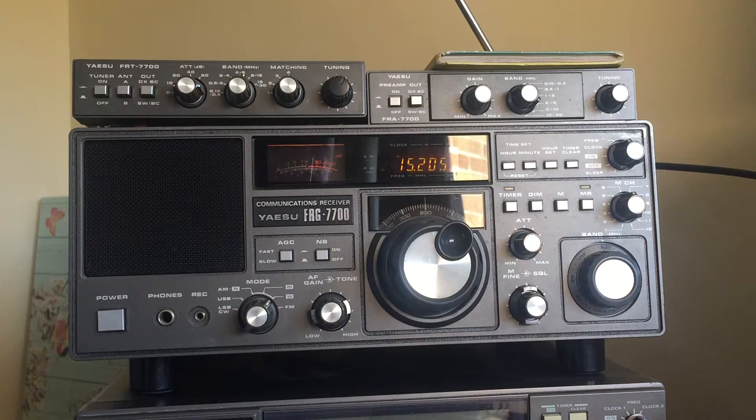While he had it, Graham suggested a few upgrades and some remedial work to hopefully keep the radio going for another 40 years. He removed the PLL board and cleaned it, stripped and cleaned the back of the band switch, and took the power supply board off. He replaced the large filter capacitor with a higher spec, higher temperature rating — 105 degrees.